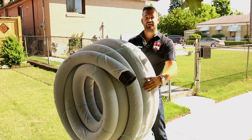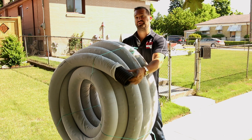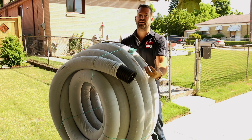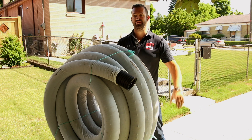Back in the day — I'd say late 80s, early 90s — this weeping tile never had this filter sock. So several projects that we excavate will find the newer style ABS weeping tile, but it didn't have the sock, and therefore it's now become either 10% or even 100% plugged up with dirt, sand, or sediments.